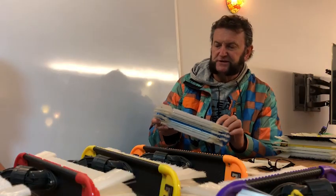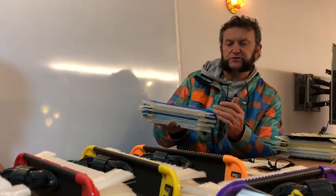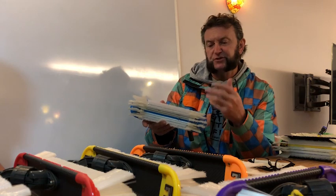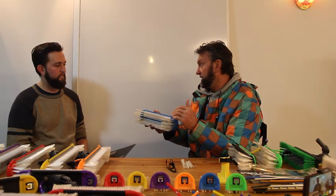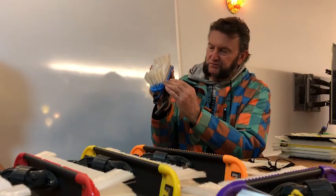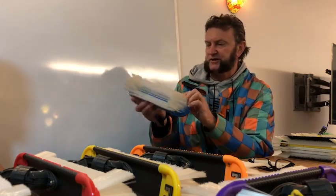beautiful. The second thing, what we did is we've actually changed the hydro blades quite a bit, and one of the things that we found was that there's certain frames that people in certain areas were hitting, and that basically they were hitting this outside jet, and it was a right angle hit. So we've got a little ramp in there, so if somebody actually does go to hit a frame, then the ramp will push the brush down or whatever, but it won't actually hit the jet at right angles.